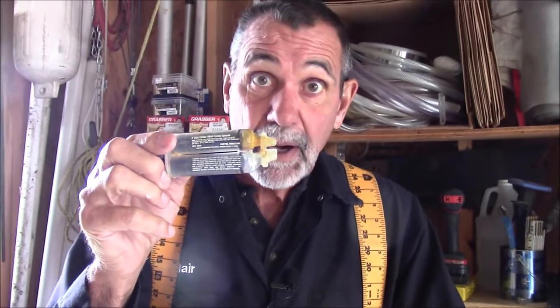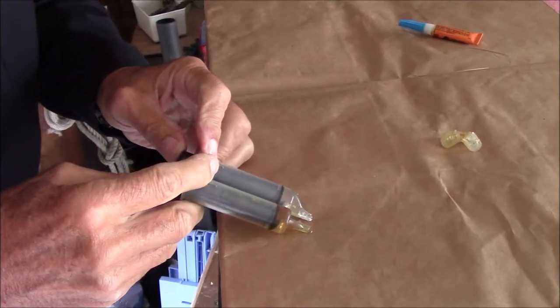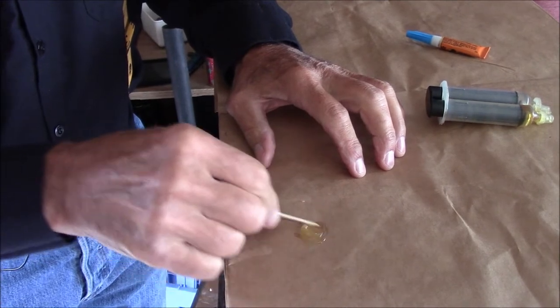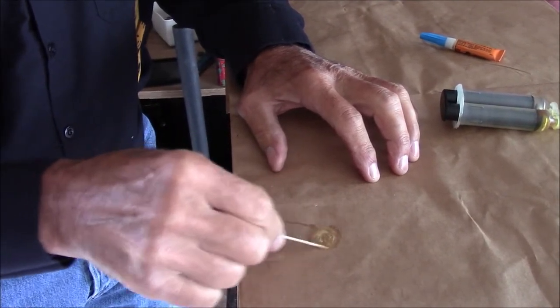This is for those of you that don't want to go buy or mix epoxy. I prefer though to use a two-part epoxy that comes in a syringe like this because it's the viscosity of like molasses. I'm not going to fill the hole, I'm only going to coat the hole. The screw is not glued into the hole, but the screw is biting into an epoxy coated hole. Mix it up real well. It's called the two-ton epoxy. I can do it with five-minute and other epoxies, but the stronger one with the slower cure time is the two-ton epoxy.